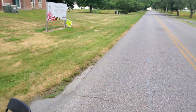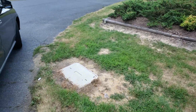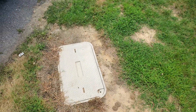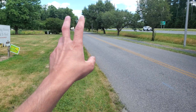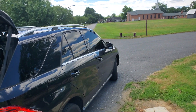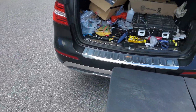This whole neighborhood over here is one of our longest runs — about 10,000 feet or so out of the POP to the end of the cable. Located right here we have a butt splice in a Thompson B case. We've got a 96-fiber cable coming in from that direction heading back to the POP, and then we have a 96 going this way.